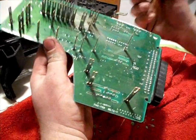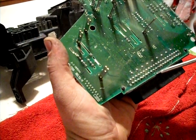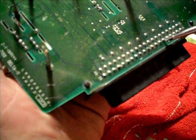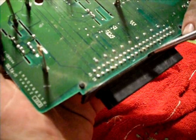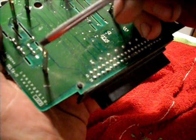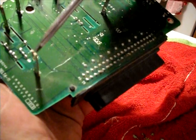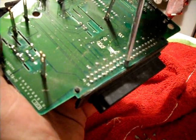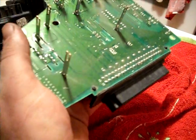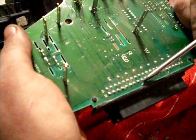Look for any open circuits or any green corrosion. What we have on this one here is this tiny spot in this line here. This pin is where it connects to the front control module, and the circuit runs right along here. This is the relay driver for the park lamp relay coming from the front control module. The ground travels from the front control module through here and then here to turn your park lights on. So what you have here in this little green area is corrosion that's opened up the circuit.